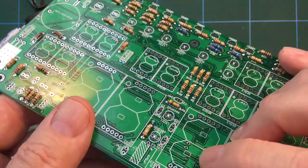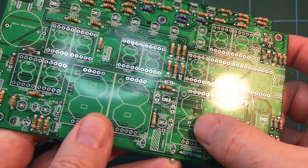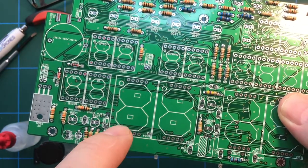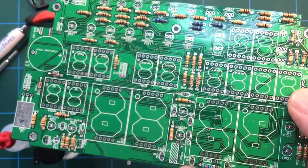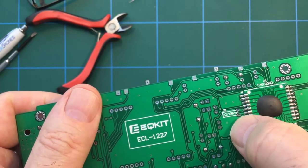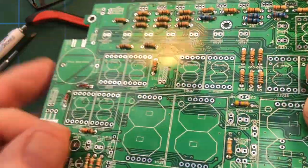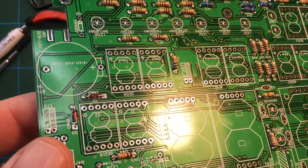And important to install it before we put that particular LED in. None of these other LEDs, certainly the big ones, have got components that would stick up underneath them, so that's okay. But we need to make sure that crystal's installed. Although, mind you, you've got to install it on the back anyway, but you can certainly solder it there, that's not a problem. Even if the LED was in, it's just easy when it's not.